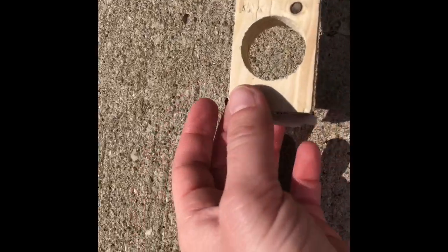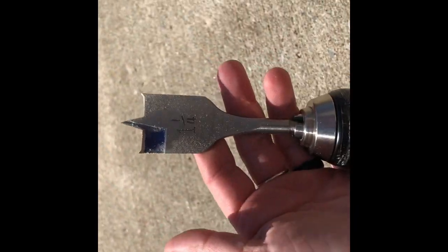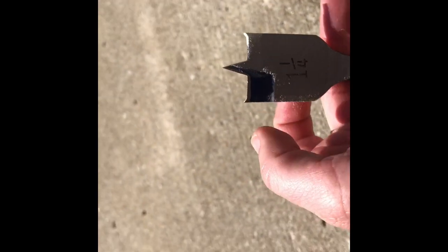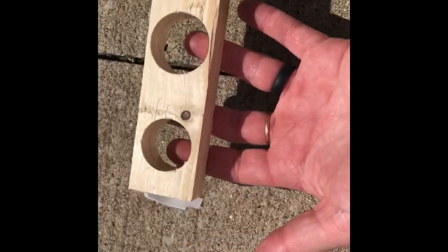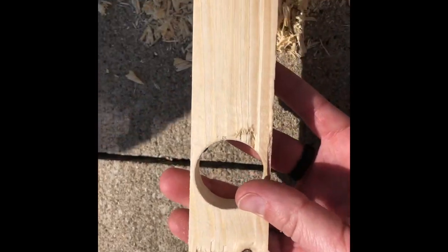I first attempted a hole size that wasn't quite big enough, so I went a little bigger. For my light fixture it's perfect — one and one-fourth inch. Definitely pay a couple bucks extra to get these little guides on the side because my wood is so skinny I can't have any problems. With that size I still had to stay on the inside a little bit to get it to fit right. These are my practice cuts just to see if it would even work, and I realize it's not very structurally sound, but this is not going to be the weight-bearing part.